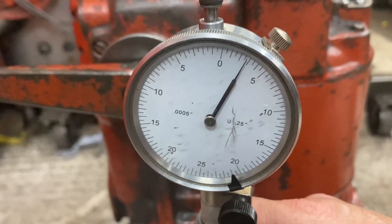So even though it's old, that machine still cuts the mustard — an excellent piece of kit. Because they're so simple, these machines also have a bit of a reputation for doing a bad job, and that's usually because people haven't cleaned the swarf out where the machine mounts to the block. If you leave swarf under there, the machine won't sit flat. Sometimes the bottom's been dropped and burred, so it won't sit flat on the block. On my one, I've tested it on many engines now and I know by doing various tests that it bores very very straight. All in all, you can't really argue — these 944s make excellent machines for the home machinist. Thank you very much for watching. Like, subscribe and help me make more videos.